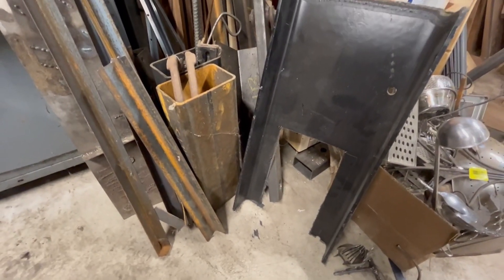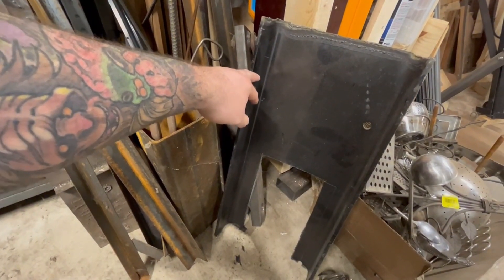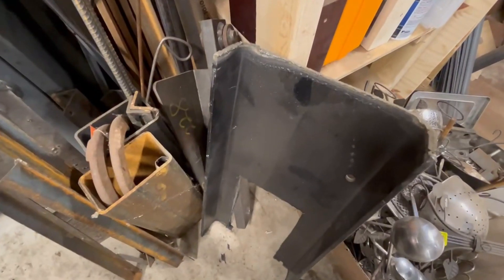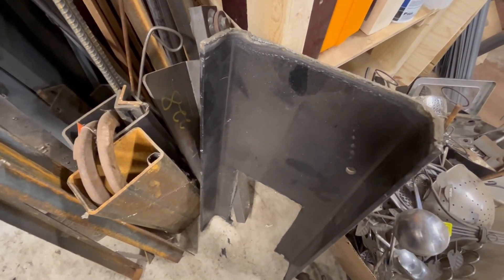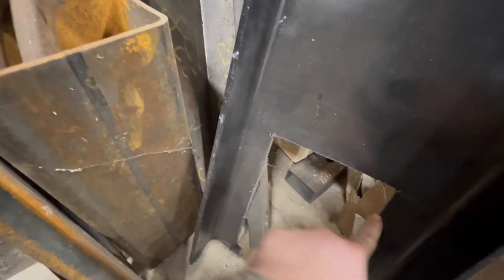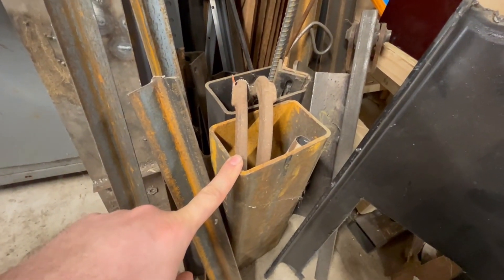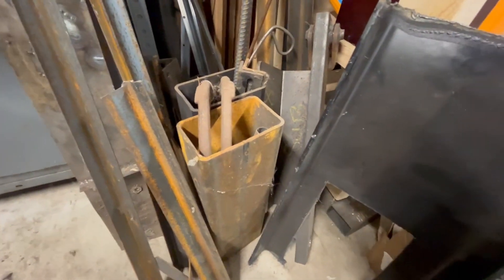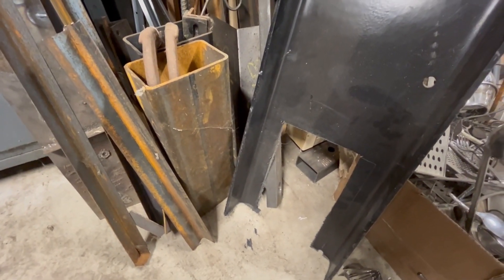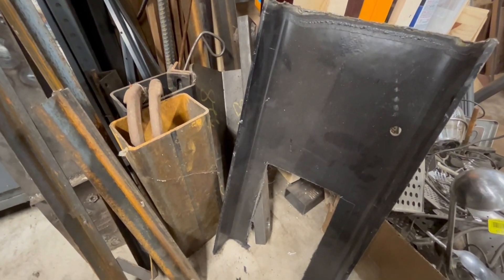On this side over here I've got a few different things. This is a cutoff from a truck chassis when they shorten the frame — that's really good steel, it's pretty thick. The only downside is the corners aren't square 90s, they're kind of rounded. However, you can cut some decent size plate out of it. These tubes are from a trailer that were cut off. If you have a place in your area that upfits trucks or builds trailers, you may be able to go to them and ask if they've got any cutoffs like this. They may not give them to you for free but they should be cheap since they're cutoffs.